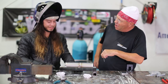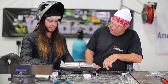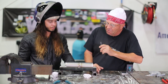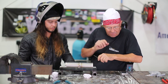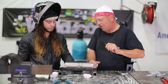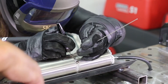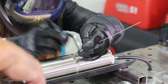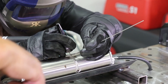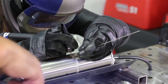How did the Reynolds cap work out? Pretty good — I'm pretty impressed with that. I saw a variety of techniques and timing. I will hand it to you, you are one super smooth little rascal. The first thing was your amperage — you have your machine set at 131 amps but you're never using anywhere close to that. When you tacked up, you hit this thing — bang, 90 amps, bang, 90 amps, in and out quick. Then you had to kind of peel things together and push and use the end of the filler wire.